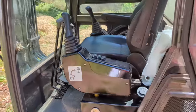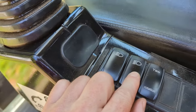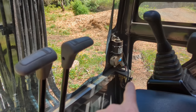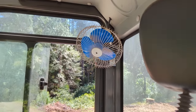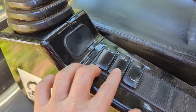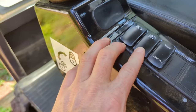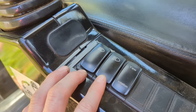Number eight: this switch right here is labeled as a light switch but does not control any lights whatsoever. It controls power to the windshield wiper, with a separate little control for actually turning it on, and also controls power to the fan — which you can control with yet another switch. To fix it, you could swap it out for a proper on/off switch for about 10 bucks, or just put a label on there with a P-touch labeler.